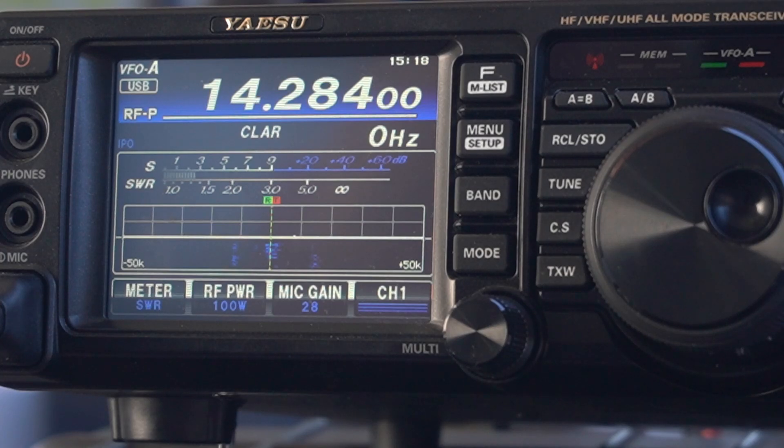KK6USY again - could I just get another radio check? I'm checking an antenna. You're like S7 into California. Oh mate, you're in the red - you're 20 over here buddy. Great signal, great audio - booming in! I appreciate you letting me come back to you. You're doing the same - I thought you were running like a thousand watts! I think the ocean is running it for me, because I'm within one wavelength of the ocean, and that can add 10 dB to your signal. Are you running a vertical? I'm just running an old Lakeview Colorado 20-meter hamstick on 100 watts.